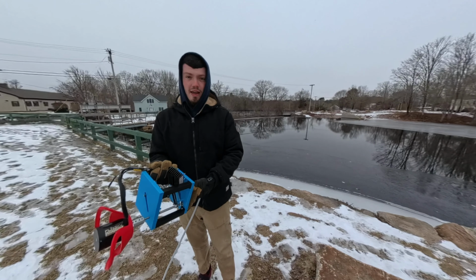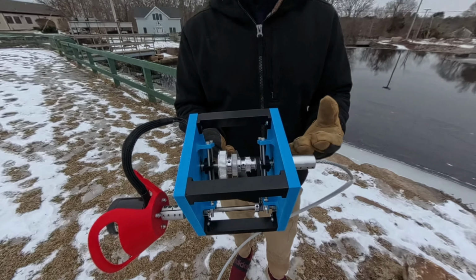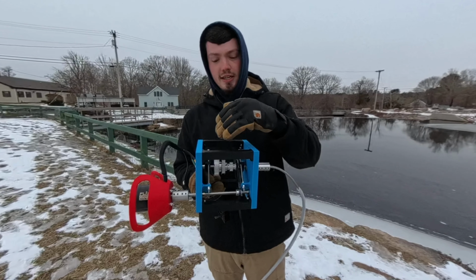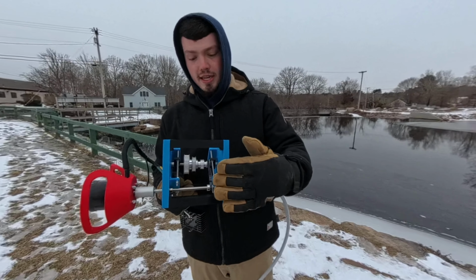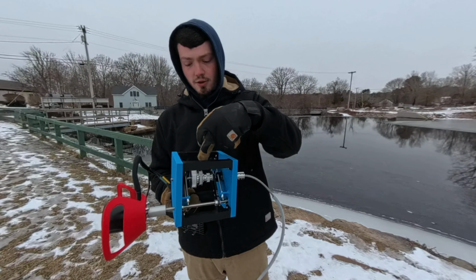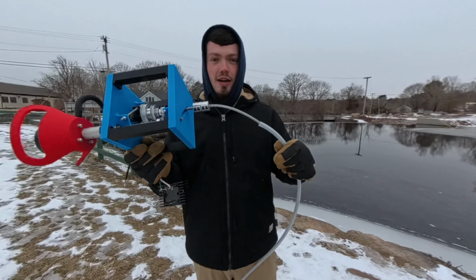Coming up, and if you have seen my last video this won't be a surprise, we've added what I'm going to call a pulley gearbox. Right now it has a 30, 36, 60, and 80 tooth pulley on this side, which is our input. On our output side, which is connected to our motor, is a 20 tooth pulley. This will give us a 1.5, slightly less than 2, 3, and 4 to 1 ratio. This will increase the speed over here by those ratios from our input speed.